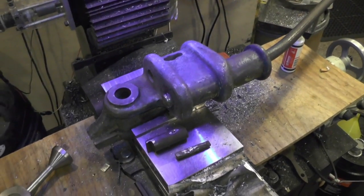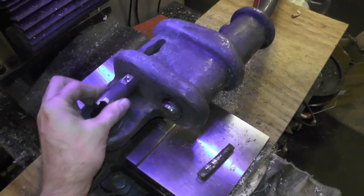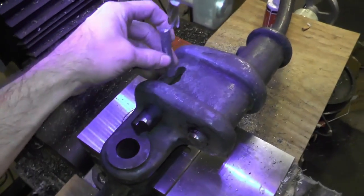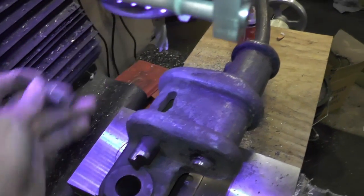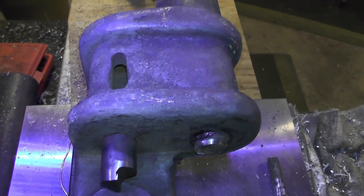Here is a shot of the ratcheting arm up on the mill vise. This pin right here is a driving pin that pushes against a ratchet. That end right there pushes against the ratcheting gear. This would get screwed down through the slot right there. The slot's all withered out and as you can see it's really sloppy in there.